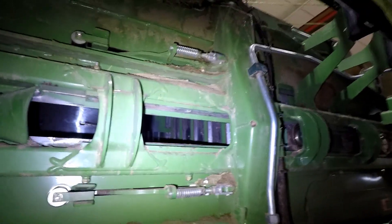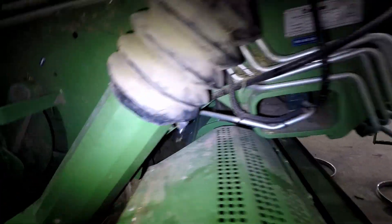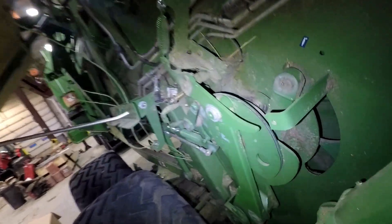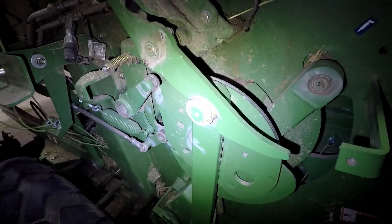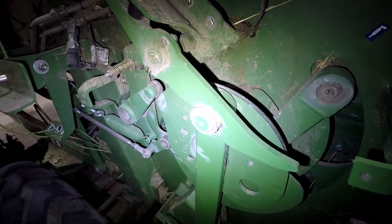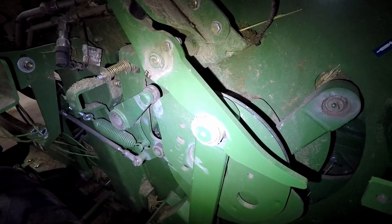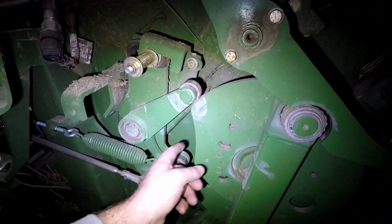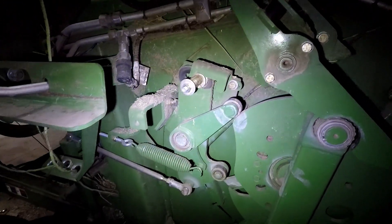Over here, we just got the other side of our entire machine. And here we have our drive coming across down to our pickup attachment as well. This is going to be our trigger arm here. So as our compression chamber fingers are stuffing the hay, when it hits, this is going to release and then it's going to actually kick the hay up all at once. So lots of little bearings to be checking, cam adjustments, spring tension — lots of adjustments on this kind of machine.